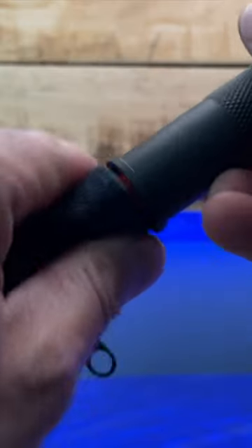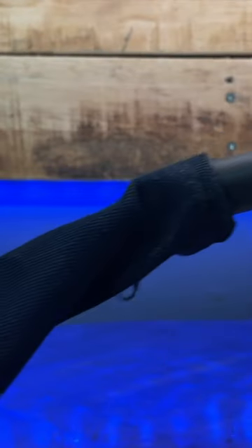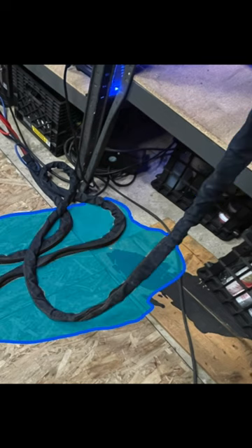This is another one I wish someone told me. What we're going to do here is tuck the sheath on the inside of the torch body. As we talked about earlier, you can develop a water leak at any time. If you have your sheath pulled over the torch body like this, if you develop a water leak, it's going to drip down inside the torch lead. You're not even going to see it and notice you have a water leak until everything's soaking wet.